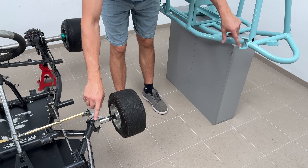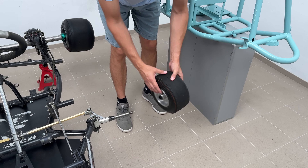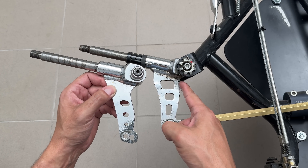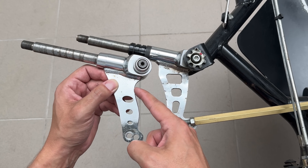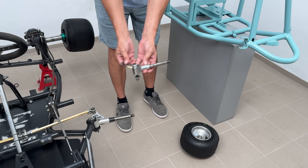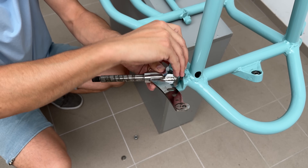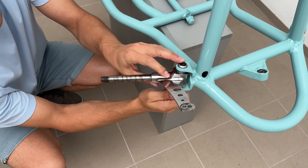Starting with the front spindles, I took the left spindle from the go-kart, flipped it, and mounted it on the right side of the new frame — a small modification was needed. I ground down a part of the spindle support to create extra space, allowing wheels to turn more from lock to lock. Using the left spindle on the right side moved the steering column and rods to the front, giving more space inside for feet.